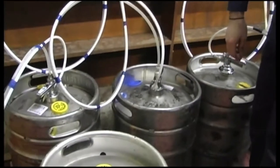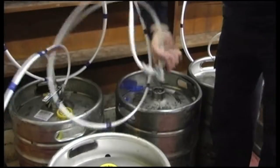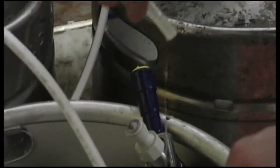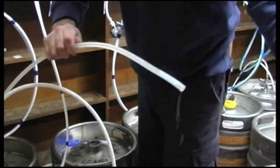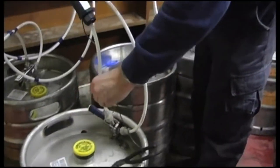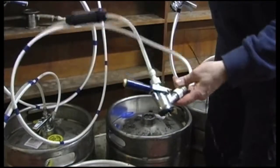This wire should be attached to the plus marking on the distribution block. The other wire, which has no marking, should be connected to the negative or neutral, which is the minus marking on the distribution block. If you do extend the wire, use proper connectors or heat shrink wraps. Do not leave bare wires exposed.